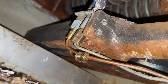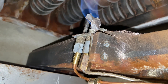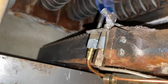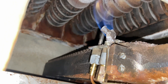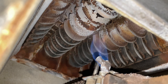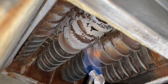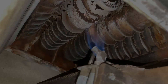We took out the burner and I put the thermocouple back into the pilot burner assembly. When they took the old thermocouple out they broke the threads inside, so I have it wedged in — it's not going anywhere, and at least it's in the right spot now, not wedged between the two cast iron burners. Looking at the heat exchanger, there's a little bit of white powder growing there — but the heat exchanger looks pretty decent. Let's put the other burner back in and fire it up.